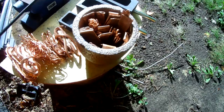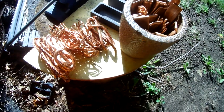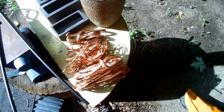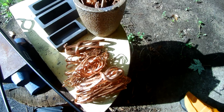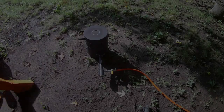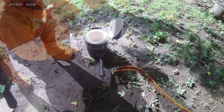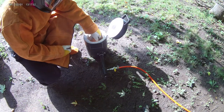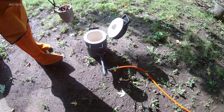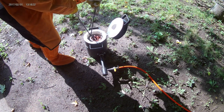Here's the pile of scrap ready to melt. I'll melt the batch in the crucible first, then add the other pieces later. This looks like a lot but once it's all melted into liquid the crucible will only be about half full. I put a piece of cardboard at the bottom of the furnace. This burns up forming a layer of carbon between the bottom of the furnace and the crucible. If I don't use the cardboard the crucible will fuse to the bottom of the furnace, and that will be bad.